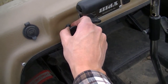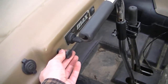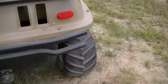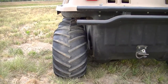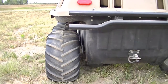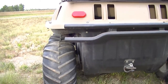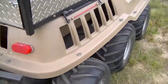I think it's got a governor issue — you've got to run the choke out a little bit. I'm pretty sure the governor needs to be adjusted. Like I said, we just don't use it enough to bother with it, but it runs good.